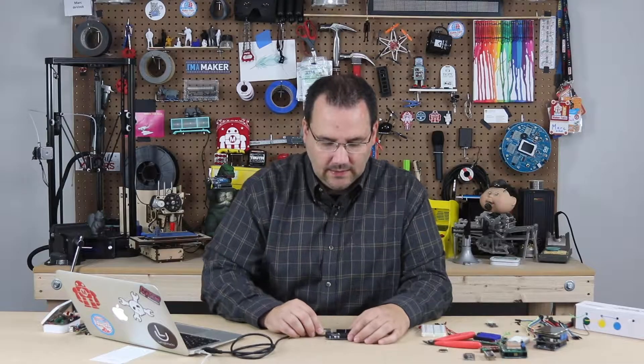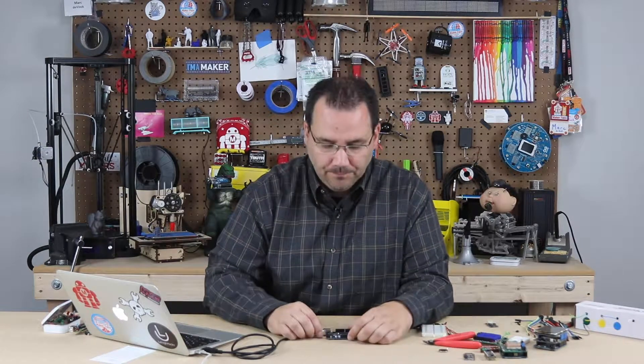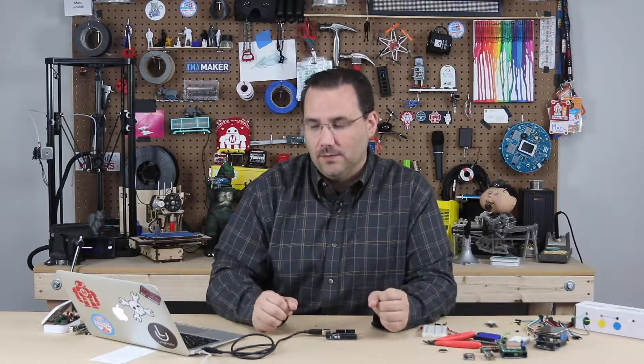What is that little LED? The Arduino people have kindly added an LED to pin 13 for us. So to get started with blinking an LED, you actually don't need anything but your Arduino, USB cord, and your computer. But we're talking about prototyping and building things, so let's look at the schematic for this and how to wire it up properly and not rely on the LED on the board.